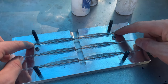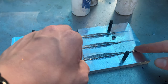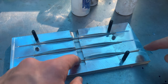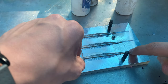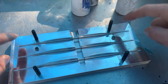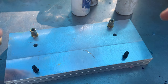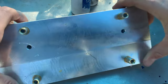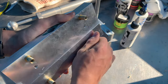After we lay in all three rods we can close our mold and inject the two colors. With this new Angling AI mold you have to make sure these rods are centered — if you have it off to the side you're not gonna get a full bait. You really have to place these rods perfectly. Once you close your mold and screw them in, don't rattle it back and forth because that will displace the rods. Then you're ready to inject.